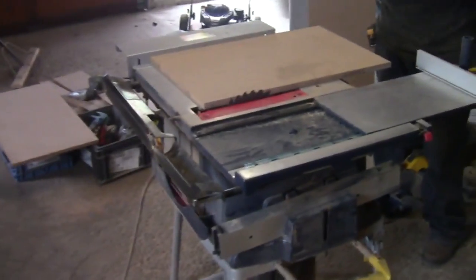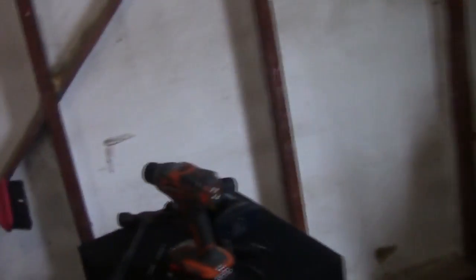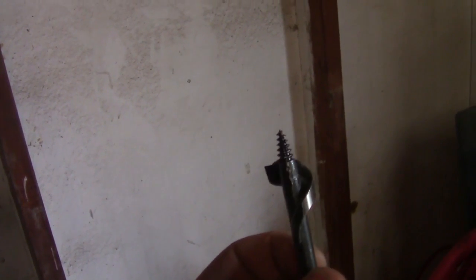We're just working our way out here — you can tell all the sawdust everywhere, on everything. We gotta make some new side pieces because I messed up, but I got one in, she's all drilled. That end is wired up; the other end is not because I gotta kill the power to the garage to wire it up — don't want to get zapped. I've got these really cool bits my buddy's lending me, made by Ridgid. It's a hole saw bit that pulls itself through once you get it started, takes no time to drill a three-quarter inch hole.